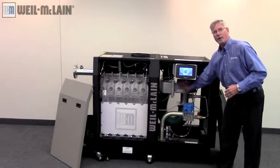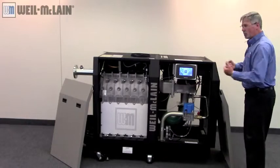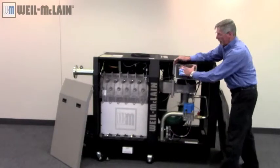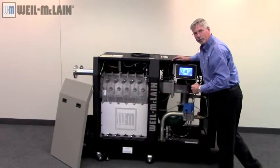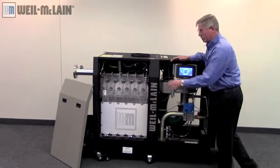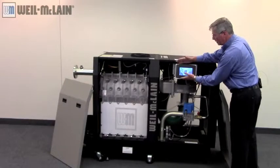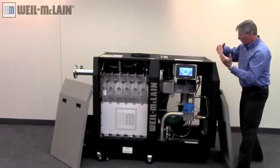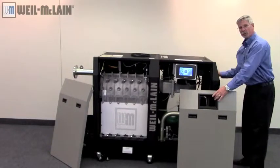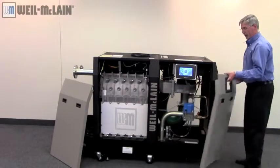The combustion blower motor is inside there — easy and accessible, easy to work on. Panels come right off. The Sola display comes factory set up on the same side as your clean-out, which helps you remember not to place that side against the wall. But if you need to, you can remotely remove it and install it on the back panel, as the side and back panels are the same size.